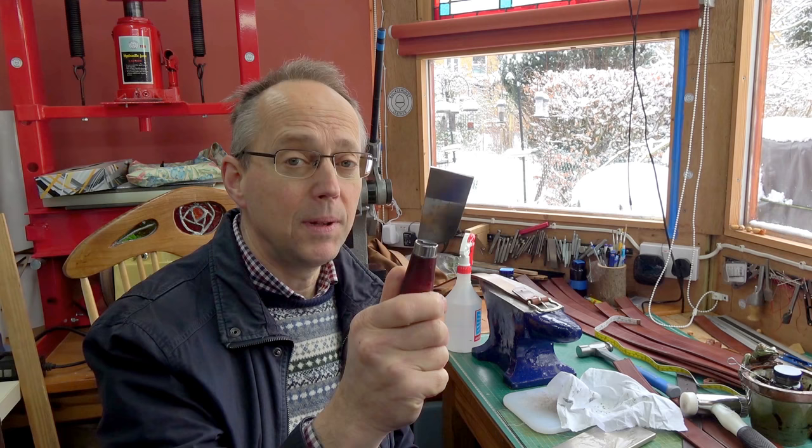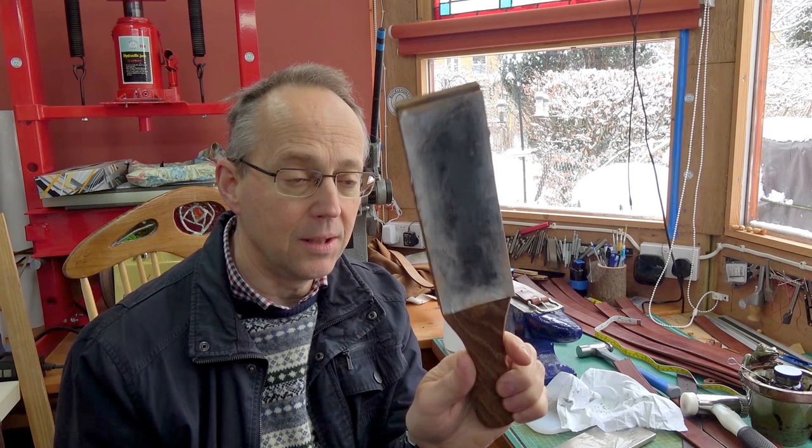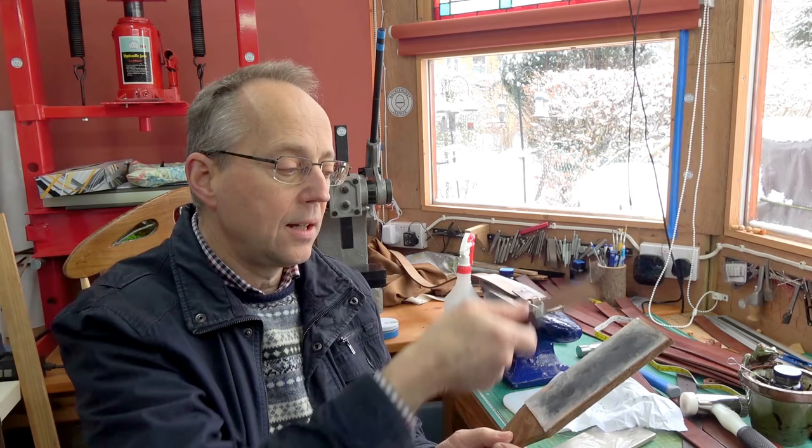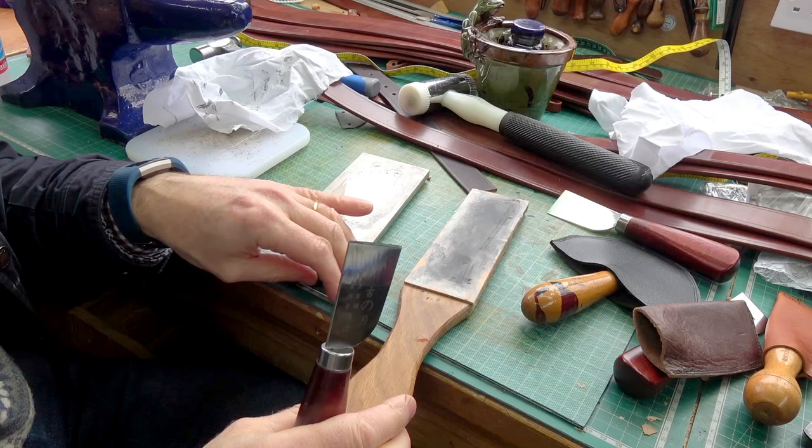Of course you can take it a bit further — if you strop it, you'll get an even keener edge and it will glide through. For stropping I'm using a little wooden paddle I made. You can buy these if you want. I stuck some Evo Stick and a bit of leather to each side. You can use any type of leather; the natural russet veg tan is particularly good because it's firm. If you've got something that's already pretty sharp you want a fairly firm strop. Then I was using a bit of chromium polish on there, and it's literally brush it 10 times one way, 10 times the other way.